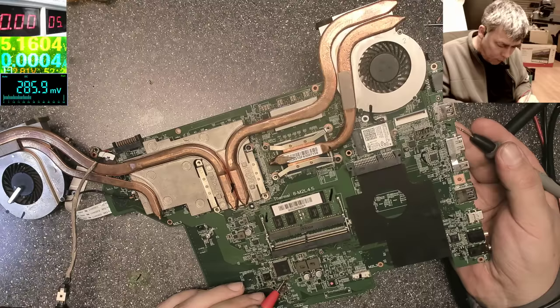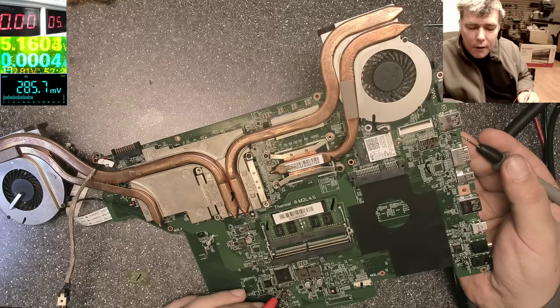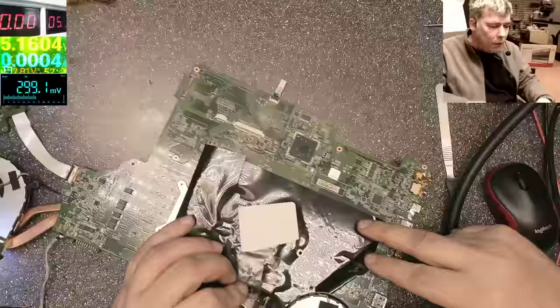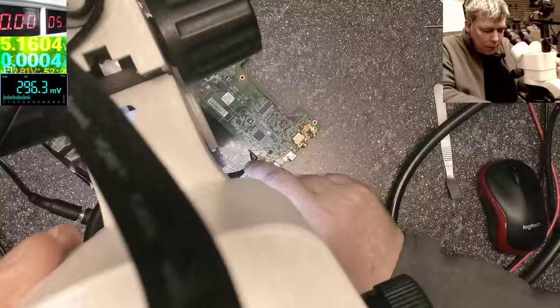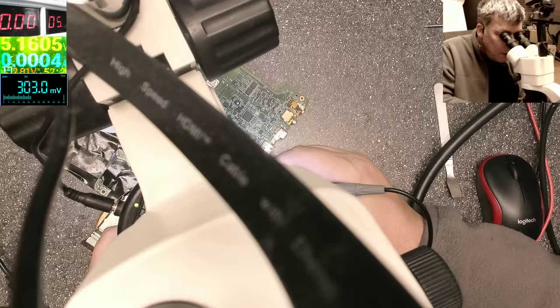It's coming here, you can hear the beep. You can hear the beep, yeah? So the track is coming here. The problem is on the other pin should be 5 volts. And it's not. The charger is still plugged in. I forgot to take out the charger, which is very bad. But anyway, the next step is to follow, yeah. I want to see where this is going.